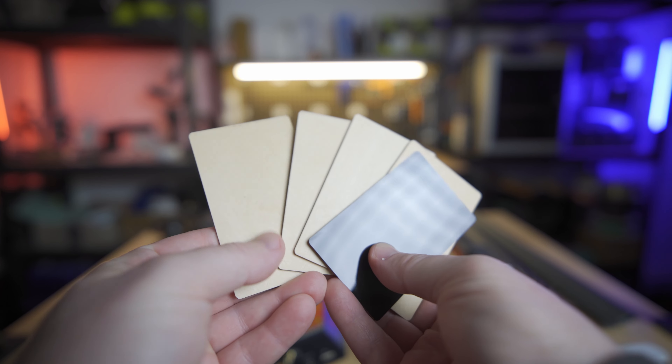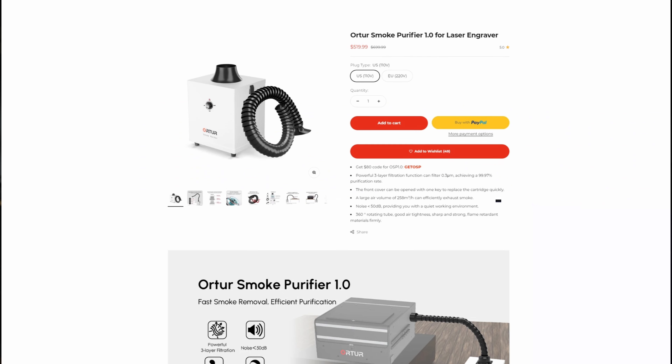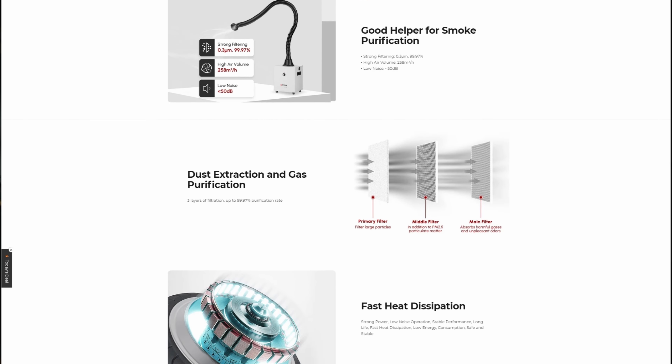As for the materials you can use with this machine, there's a whole bunch — things like wood, leather, metals, stainless steel, porcelain, and a bunch of others. It'll be a matter of experimenting to see what results you get with these different materials. Just be aware: lasers are burning instruments and you need to do some research on any material you plan to work with to see if there's anything hazardous released when it's heated or burnt. I'd probably recommend getting some sort of ventilation for the work area as well.